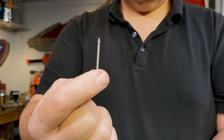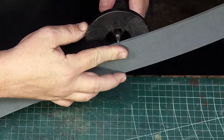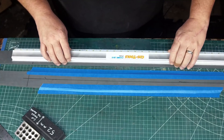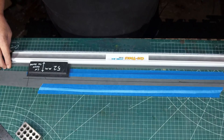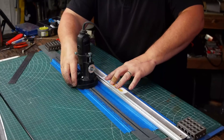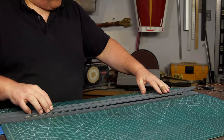In the past the bit I mostly use is the number 125 high speed cutter for making V grooves. Today I'm going to use a 117 carving bit. I set the bit to a cut depth of about three millimeters — half the size of the graphite rod. To keep the blade blank from moving I tape it down to the table, making sure it's sitting straight. This metal ruler works great as a small router fence. The carving bit creates a half round channel in the foam. I make one in each blank, running the rotary tool back and forth to make the channel just a little wider, which will let me very easily fit the graphite rod inside the blade blank, keeping the sword from flexing.